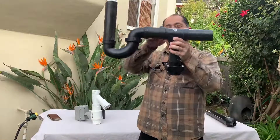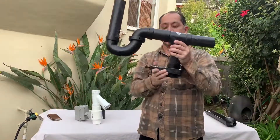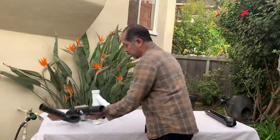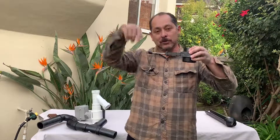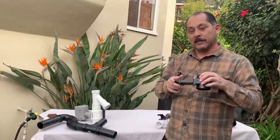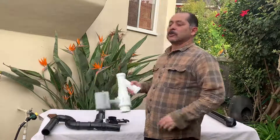When you want to use gray water, you just close it, the water backs up and comes back out into the gray water system. What's nice is that we extend the handle arm — you can get an extension rod at Lowe's — all the way out to the outside. We drill a hole so that from outside the house you have this handle sticking out. You open it and water goes down to the sewer, or close it and it backs up into the gray water system. Out of everything we've done, we always go back to this simple gate valve.